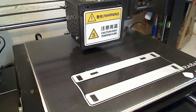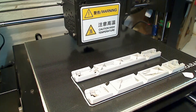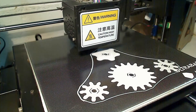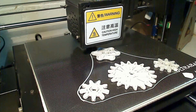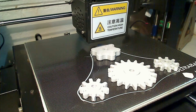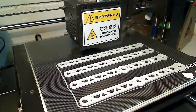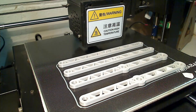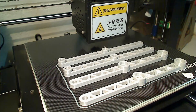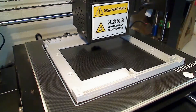The 3D printing itself is straightforward, with no printing supports necessary. I use PLA at a temperature of 205 degrees Celsius, a bed temperature of 50 Celsius, with a 0.25mm layer height and a 0.4mm nozzle on an Anycubic i3 Mega. The scissor arms were printed with 100% infill, while the other components had 5% infill. The STL files are available on my website for anybody interested, and if you would like any further details, let me know in the comments.